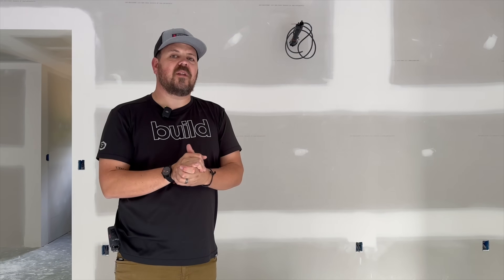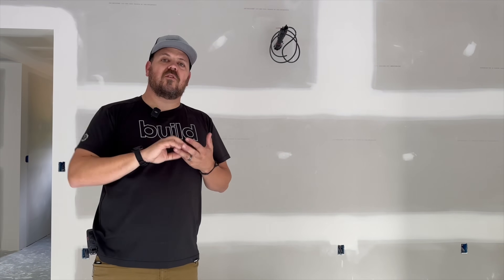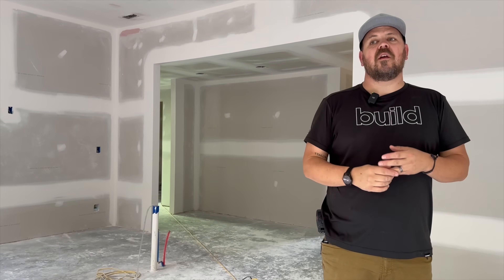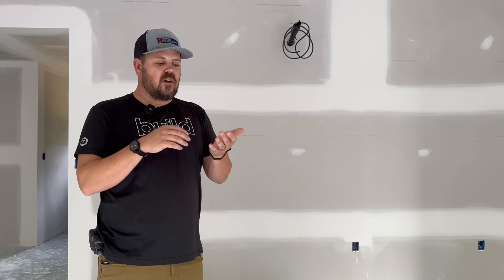So how do we resolve that? People love big windows, so we're probably not going to get rid of big windows. They love big volume ceilings, so we're probably not going to get rid of those either. The next challenge is wall sconces and raking light where the light fixture is close to the ceiling and spreading horizontally across it. Those are design issues that are probably going to be out of your hands as the builder and will be challenging to deal with from a mudwork perspective. I would recommend you look at level five in that situation — same as the raking light from the door. The places I've found those to be the biggest problem are ceilings and walls in stairwells where you're going from one to two floors and have a raking light or sconce that shines up and down.